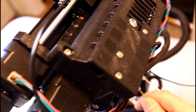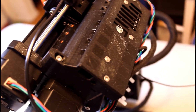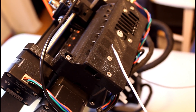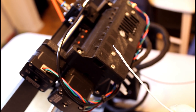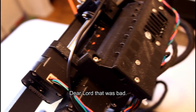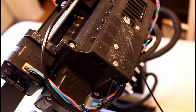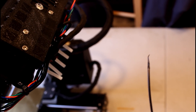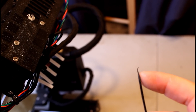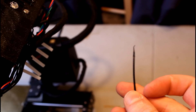Okay, let's check out my filament tips. Here's the gold, here's the white — so they're not really what you'd expect. Kind of like spears — not sharp and a little warped. Here's the black. They're not exactly what you'd think the perfect tip would look like. They have this little bend at the end, but that doesn't matter — the pointy end is thick and stout enough for the gears to grab onto, and it helps everything flow through. Believe it or not, this shape seems to work out well.